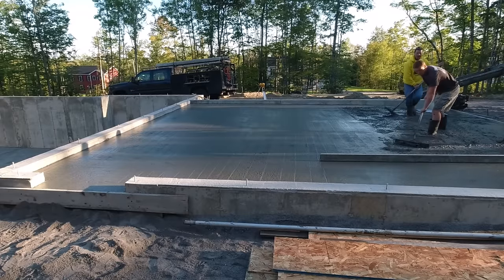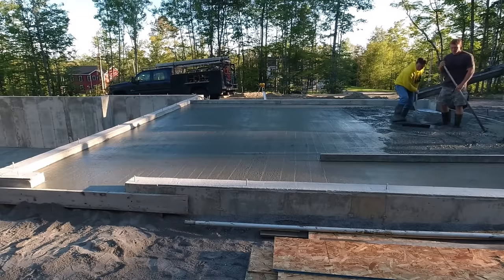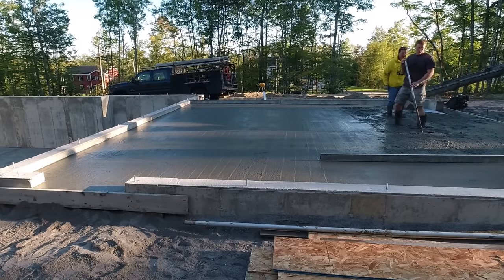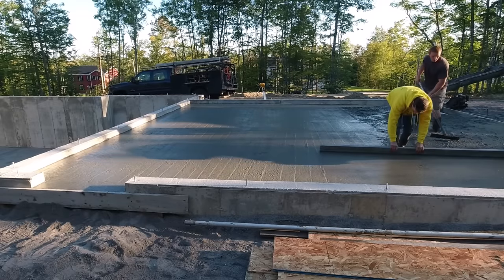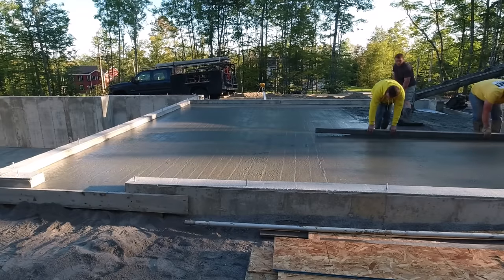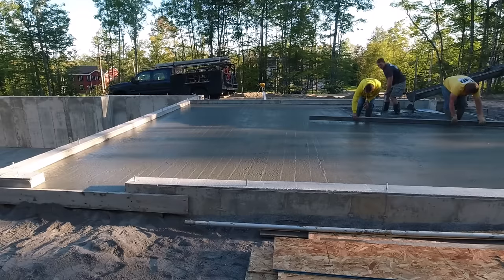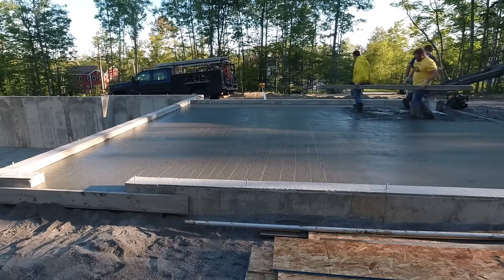Right now we're just a little bit low, having to kick too hard, so we want to make sure we've got plenty of mud by our boots. Because this is going down relatively fast — we're about 10 or 11 minutes into this pour. We don't usually bull float anything until we're done screeding — we'll get it all screeded and then one guy comes back and bull floats it. I'd also like to know from you guys: where are you watching from, and do you think this is relatively fast for a three-man pour? Would you screed this any differently?